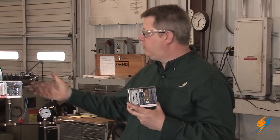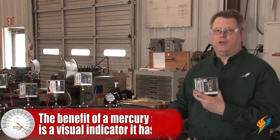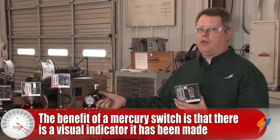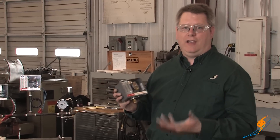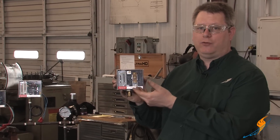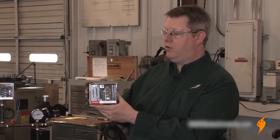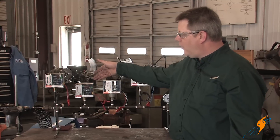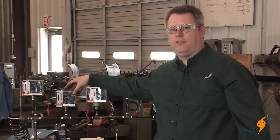Many original old controls on earlier generations of boilers will have mercury switches. The benefit of a mercury switch is it gives you a visual indication of whether the switch is made, which is very convenient, but unfortunately they have mercury in them which is something they're frowning on in many facilities. The replacement for that is a micro switch style control — what we lose is an actual visual indication of its trip point. So these two controls serve the purpose of starting and stopping the boiler: this one routinely, but this one only in the event that the operating limit doesn't work.